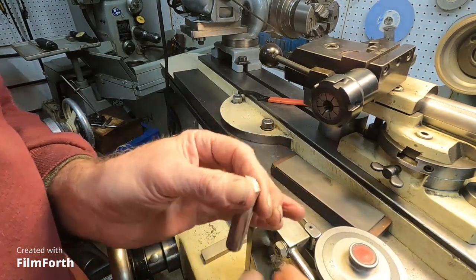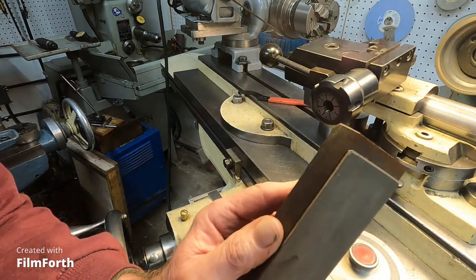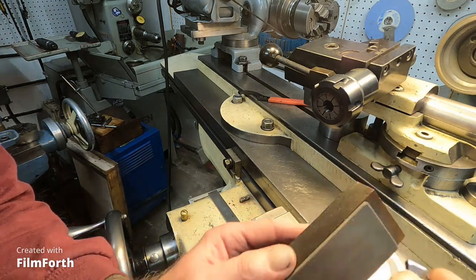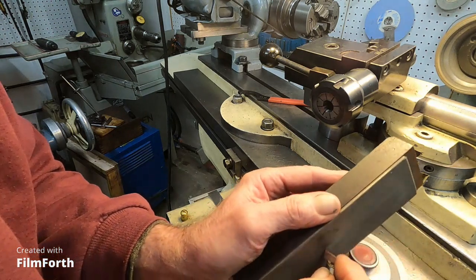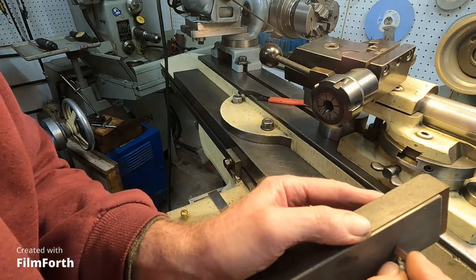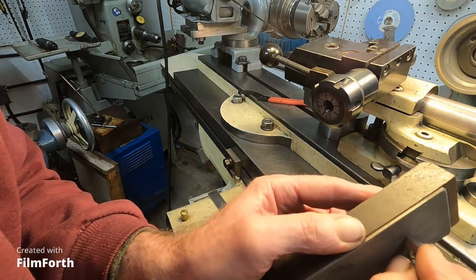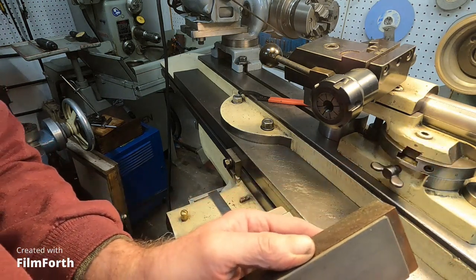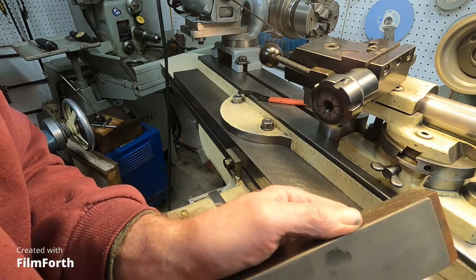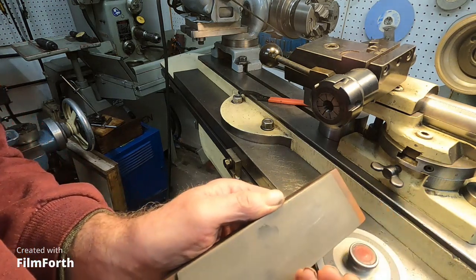Just starting to see a line there. I'm going to go both ways with it — you can kind of feel the drag. This is a thing that is totally by feel, and you have to practice at it. I've used Cincinnati monosets and OK radius grinders and stuff like that, and it's very difficult to set one up for such a small radius — I guarantee it. It's just easier to do it like this. But machine grinding has a huge advantage of being able to change all these angles at any time as needed for the material.